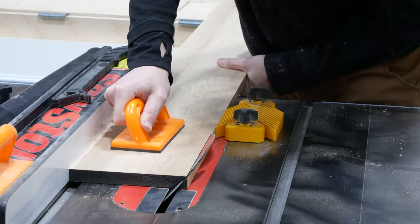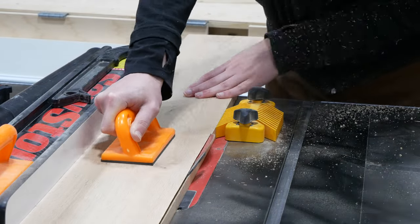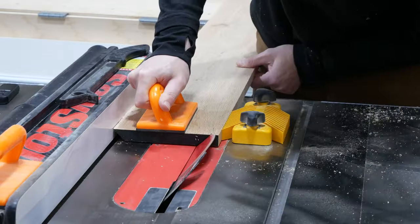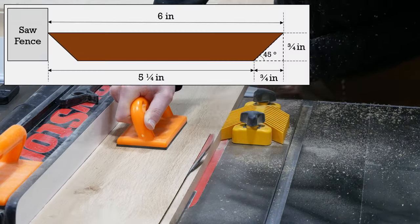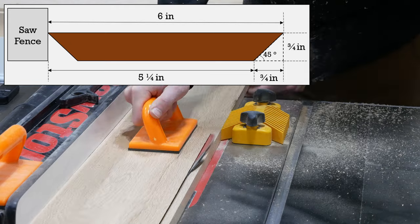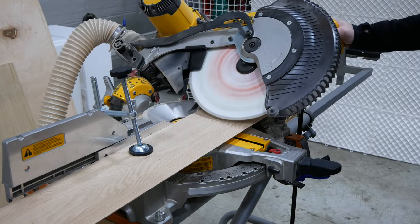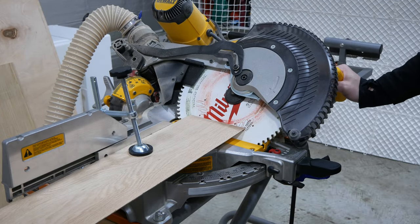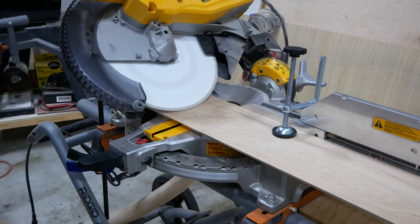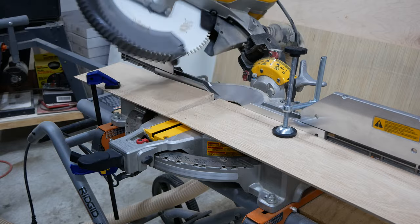The board for the front of the beam is very similar to the top and bottom except it has a mitered edge on both long edges. I need it to be 6 inches wide but the saw fence measures to the base of the blade, so quick math told me to set the fence to 5 and a quarter inches. It came out just slightly under 6 inches, which I'm happy with. I cut this front board to length like the top and bottom pieces, except I left some pieces longer than the depth of the beam on the outside of both cuts, and I'll use these extra pieces a little later in the video.